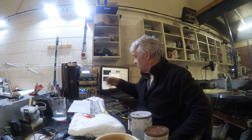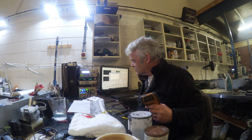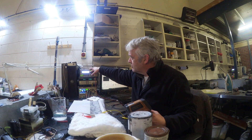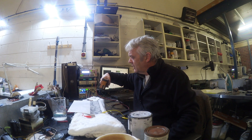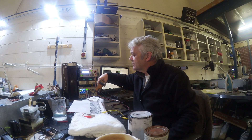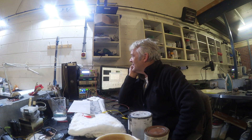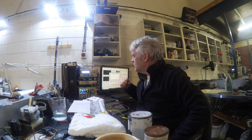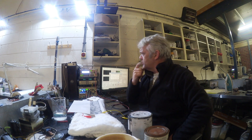What I'm doing here is reading the voltage across this zigzag — my thermoelectric generator. And actually it's quite astonishing. So if I turn on the power, it's 10 volts at 2.6 amps, and almost immediately you can see that voltage going up. It was at 0.1 millivolts and it's now at 1 millivolt — it's gone up tenfold in a few seconds. The difference in temperature is 11 degrees on one side and 12 on the other. So it's a one degree difference and we're getting a tenfold increase. It's shooting up in terms of millivolts — it's at 9 millivolts now.